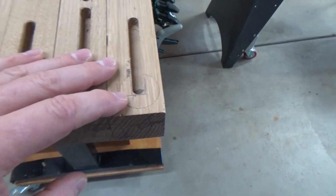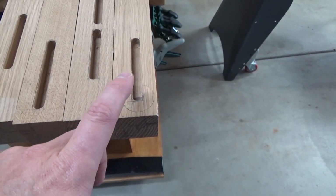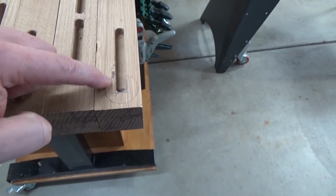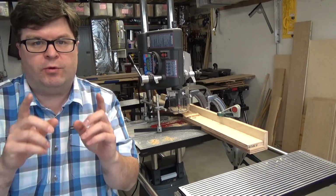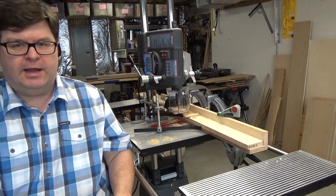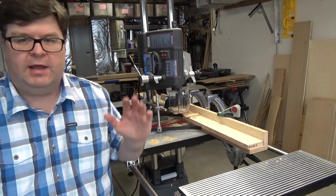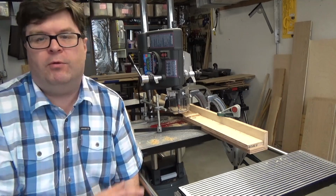However, I'm not giving up on this right now because I am going to be staining this entire bookshelf more of a darker brown, and this dark seam line will most likely hide within that. So that's all the mortises for the 1930 millimeter long or 76 inch long uprights for my Stickley bookshelf. And this setup did the job, but it's too crazy. It takes too long to set up, and given the quality of the results, it's just not worth it. It was a fun experiment, but I don't think I'll do it again.